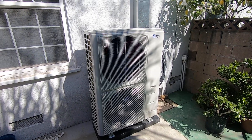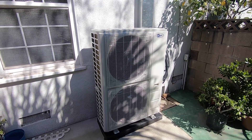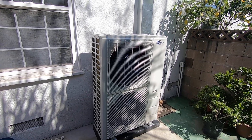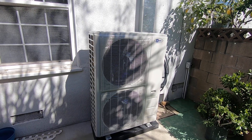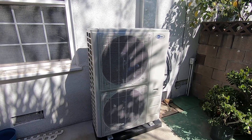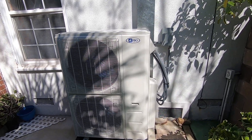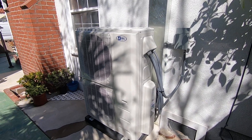Right now it is running — you can see there are two fans on it. It's on a lower speed; only a few of the zones are on right now. The model number on this is A50G-48HFN1-M. It is made by Midea and branded by AC Pro. The efficiency on this unit is 23.4 SEER2, so it is extremely efficient, especially because it is multi-zone.